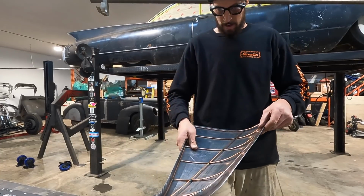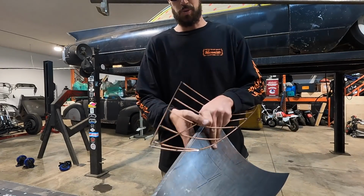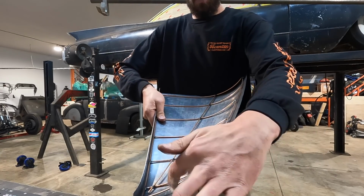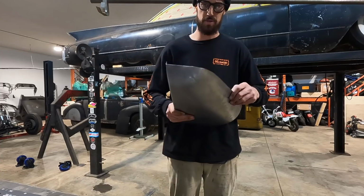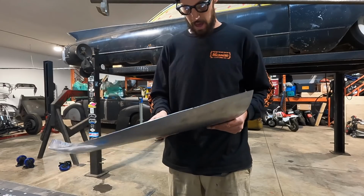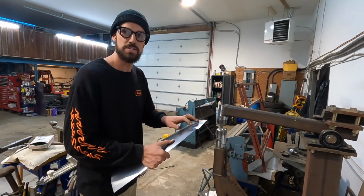All right. So we've done one pass through the Shape-O-Matic, one pass through the planishing hammer, and I've just gone back to the English wheel in order to try and get the profile right. And I'm getting close. I think I need to shrink a little bit more in this area. From the paper template, it actually has a little bit more shape than I thought, and maybe Karl thought as well. So I'll go back in here, add a few more shrinks back to the planishing hammer, smooth them off, put it back over top of the wire buck, and see how far we can get. So we'll go back to the power hammer. That was one pass back out, and then I'll try and maybe do 3 small ones this time.